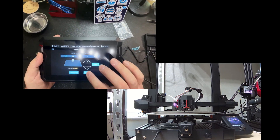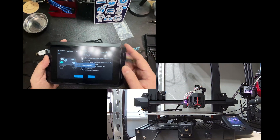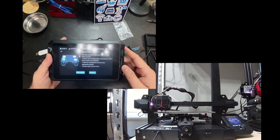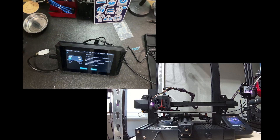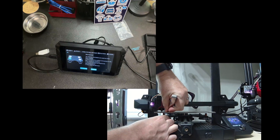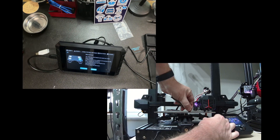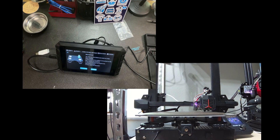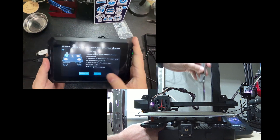Let's go ahead and hit next step. It says Klipper will restart, but let's see what this will do. I've homed, and I'm just clicking on each point on the screen — as you can see, it's moved my nozzle. Now I'm going to switch over and adjust each corner. I have this printer in the world's worst position to show on screen, but that feels all right. Let me check each corner — that feels good. Now we'll go on to the back: 0.4 and now it feels good. Let's go ahead and move to the next step.